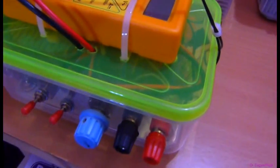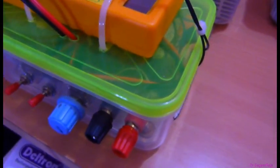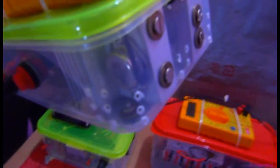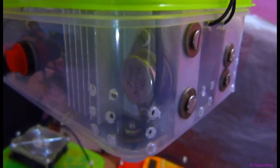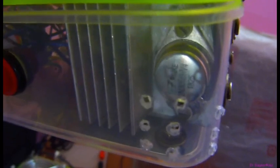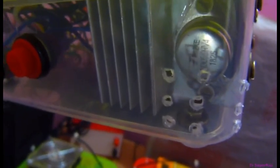This one has the LM350 with a current boosting heat sink — you can see two 2N3055 transistors inside. It must have a heat sink for proper working. You can see that the body of the TO-3 package is the collector, and you must solder the terminal to the body. The TO-3 package must be very carefully mounted to the heat sink.